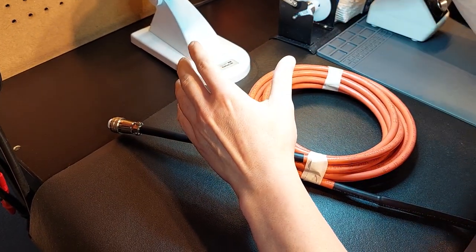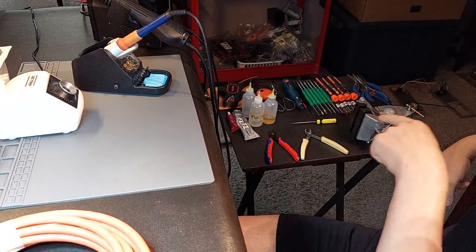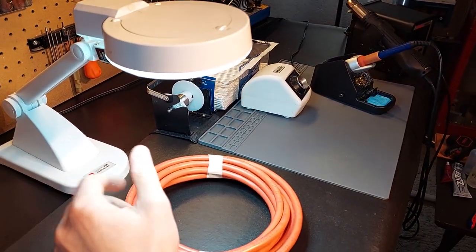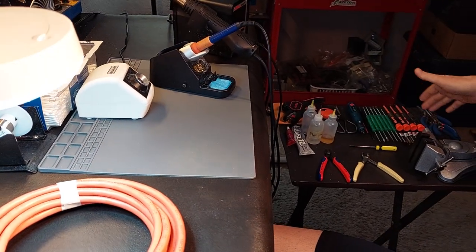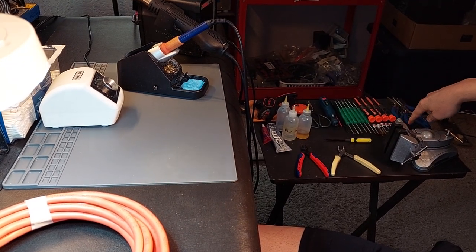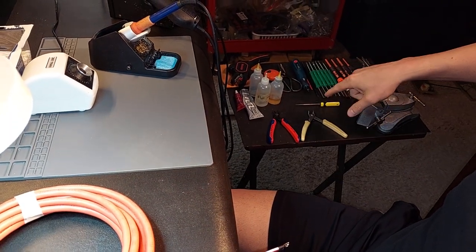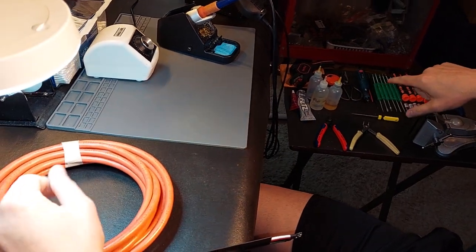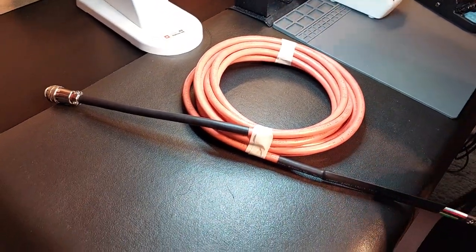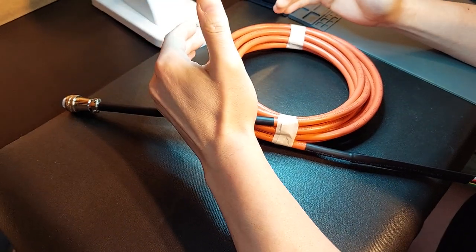When I say my tools, everything you see here was used to create these kinds of cables. I've been told my work desk looks similar to a doctor's layout - I do that for a reason because that is what I use. My Deoxid - each one of these bottles is between nine and twelve dollars a piece, you can look them up online. Soldering flux, Kester products all the way across - Kester 186, Kester number 44 solder. I had to build these cables, and all of my components are built to my spec, as what I would do for my own systems.